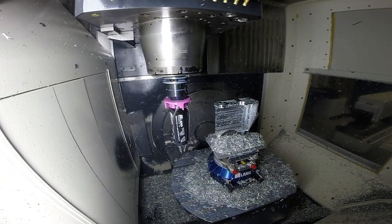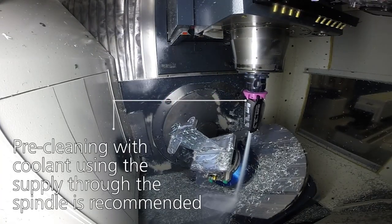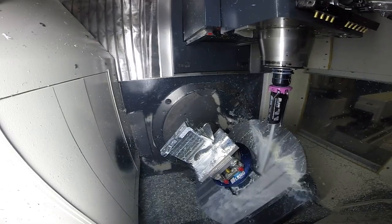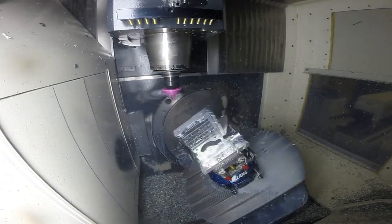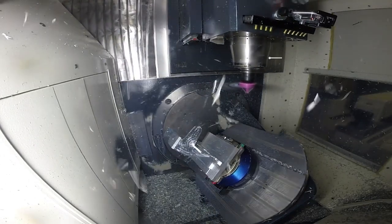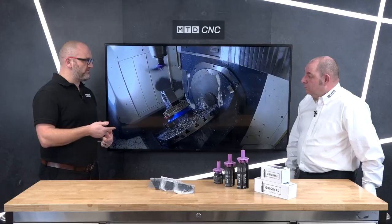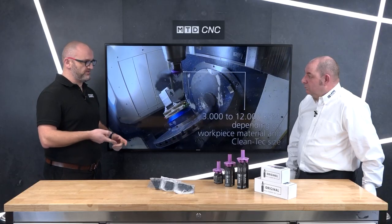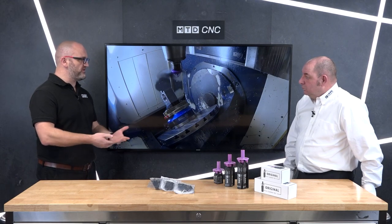There's automation — you're picking up billets in vices with swarf present, and coolant could go all over the floor. But one advantage not necessarily talked about a lot is the difference between roughing and finishing. When you rough, the swarf present on the part means you're coming in with a ball nose to scan the part, and if you start recutting those chips, your tool life is going to be reduced and so is your surface finish. So maybe introduce this tool between the roughing and finishing cycles.